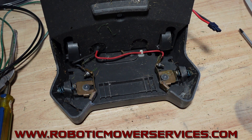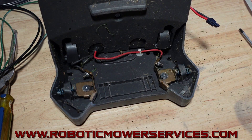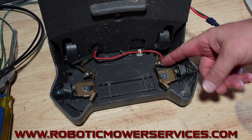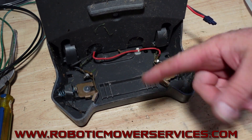Just think of it this way: if you have a 315X, the transformer for that mower puts out 28 volts DC but at 1.3 amps. If you have a 430X, the transformer puts out 28 volts but at 4.2 amps. The 450X has a transformer that puts out 28 volts but at 7 amps. That's the difference — that's why you can't just look for 28 volts and say you've got enough voltage. You have to have the proper amperage too, and any kind of resistance or bad connection is going to hamper that current getting into the mower.